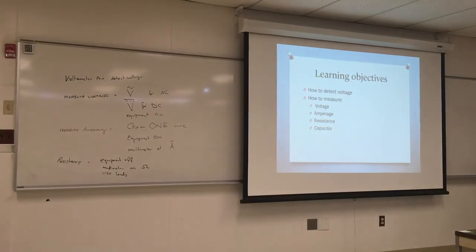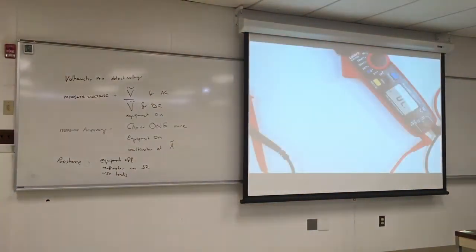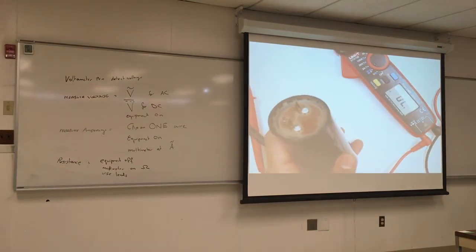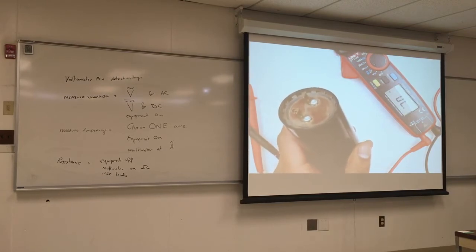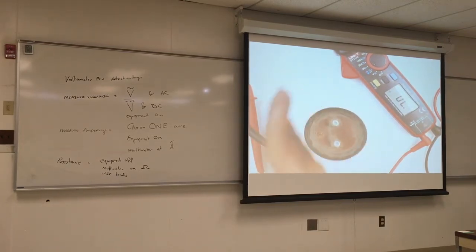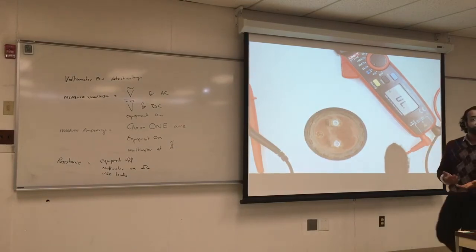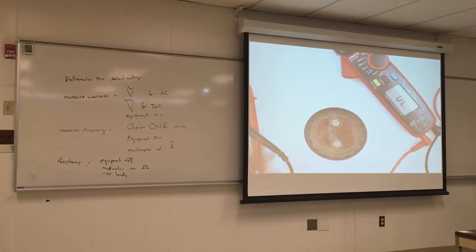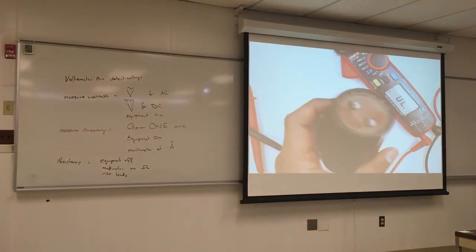Capacitor. Okay. That is very important for you as an HVAC technician. Why? Again, where do we find capacitors? Where do you find these things, capacitors? Near motors. A lot of motors require capacitors. It is conducive to smooth running and starting the motor. Some motors have more than one, a run capacitor and a start capacitor.